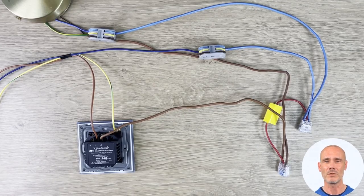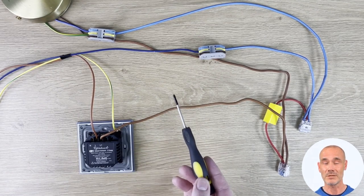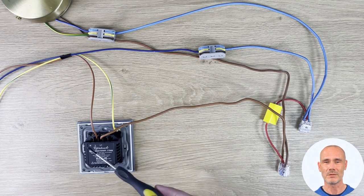In this video, we will show how to wire the switch without a neutral cable, adding a switch to your network and how to set up a two-way wireless connection. Please note this setup is only required if a neutral cable is not available.